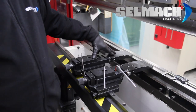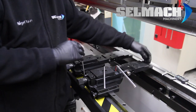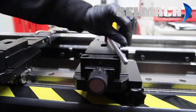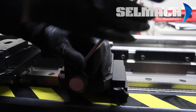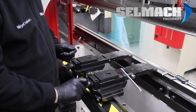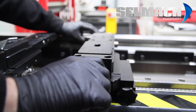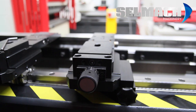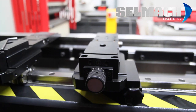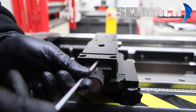This probe is the one we're going to datum on as well. We've got 50.56 here and we need 50.56 here. Basically, we undo this, undo this, then undo this and release off the grub screws. You then adjust this knob here, taking a measurement at the same time from the front of the probe, and adjust it until you get 50.56 — or whatever figure you have. At that point, you lock this up and you lock this up.